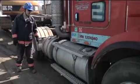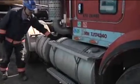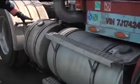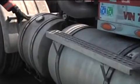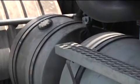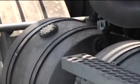On the cab hauling the low boy detachable trailer, on size-up you can see that the larger tank is for diesel and the smaller tank is for hydraulic oil. You can tell because it has a pressure relief and you can actually track the lines that go to powering the hydraulics.